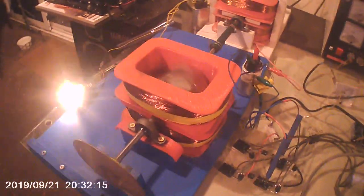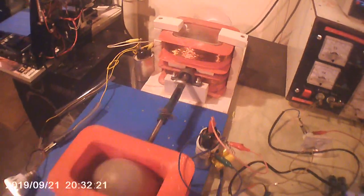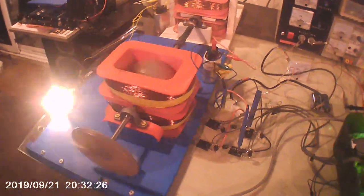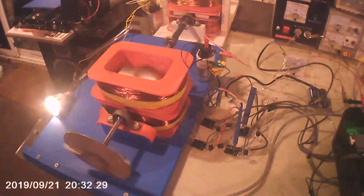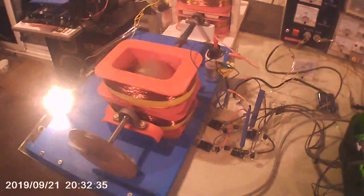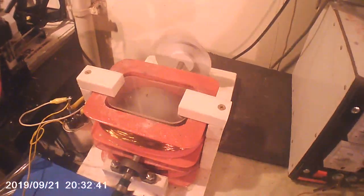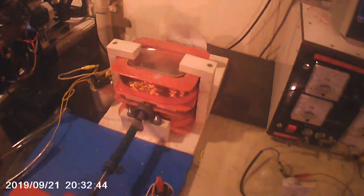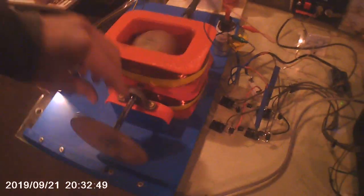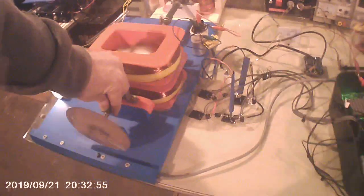What I want to do with this test — in the last test for output power I was running the generator into an incandescent globe, and I was getting about 40 watts input power, and the incandescent globe was only putting about 25 watts out. So the efficiency was quite low. That's because these machines need to be built big. There are quite a few lessons we've learnt along the way, but they produce very good torque — extremely powerful torque — very cheaply. You can put an awful lot of pressure on these shafts and it makes very little difference to the input power.